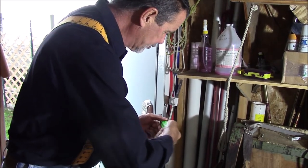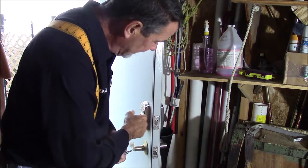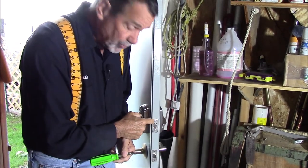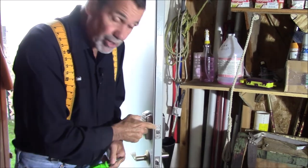The advantage of it is the epoxy is strong. If I had to take the screw out more than once, the epoxy gives me a coated hole that will achieve that. A long-term cure for fixing a stripped-out screw in wood at MrHardware.com.